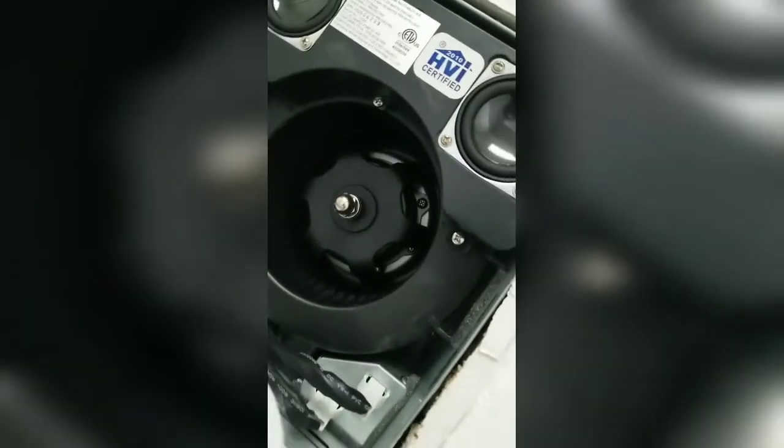Okay, folks, up here is pretty much just plug and play. These 2 wires that are sticking out of your housing, you're just going to plug back in. And then there are 3 wires coming out right here that you plug into the cover of the fan. There are 2 clips right here, one on each side. You bend those together, close them together, and they go inside these on each side. So you bend them together like this and put them in there, and then they spring open, and you push it up, and that's what holds the cover on. And that's all it is.